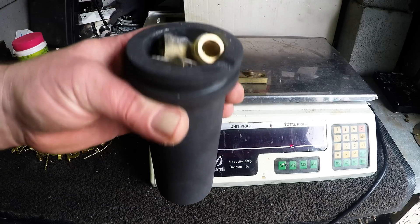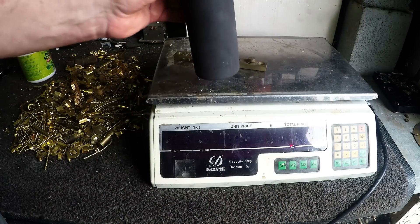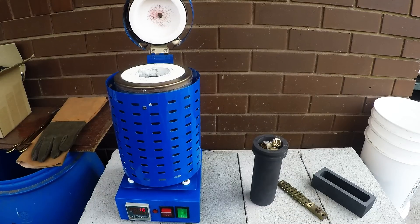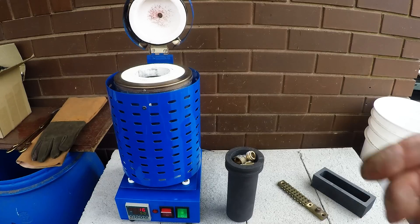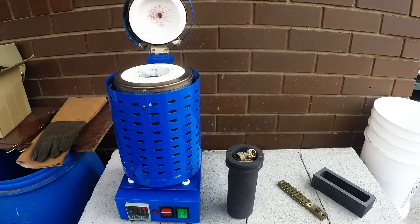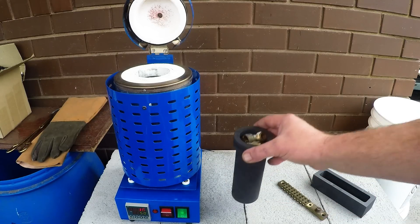I'll go and take it to the furnace and we'll fire it up and see if we can get a 1kg brass ingot out of 1kg and 30 grams. I've got a new little set up outside for this one, because as I mentioned the brass has got different kinds of impurities. They can also put arsenic and some not-so-good stuff in there, so I don't want to risk breathing it in. It's a very windy day today, so I'm outside of the garage just so no fumes build up anywhere and we're a lot safer.